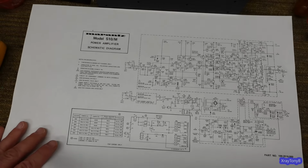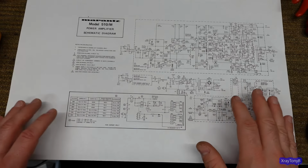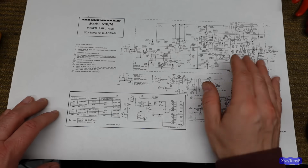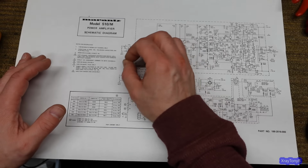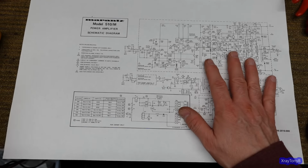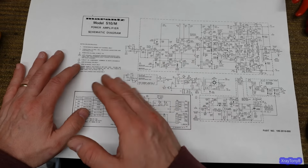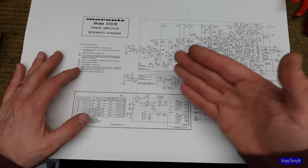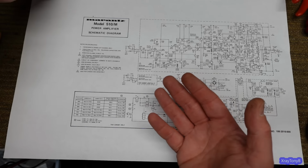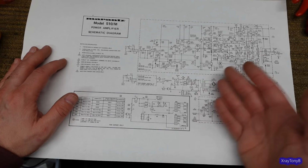And even if you don't want to take the time to print things out like this neatly, print a schematic out and take a pen or a pencil and make notes on it. As you go through and study a circuit, it's a good practice to study circuit diagrams like this to learn how they work and to try to understand them. It makes it easier for you to do troubleshooting and so forth when you do that.